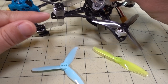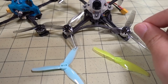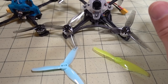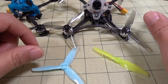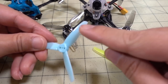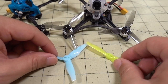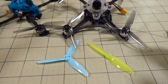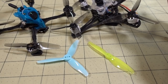If you want to use a smaller motor with a smaller ESC, a lower pitch prop like this is going to be beneficial. But if you're looking for maximum power and going full throttle all the time, you're going to want a bigger motor, bigger ESC, and a prop with a lot more pitch. Something like the 3018 is going to give you a lot of punch in that situation. It really depends on your preferences and what you're looking for.